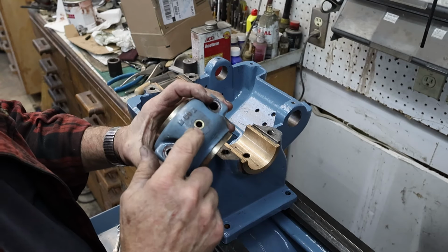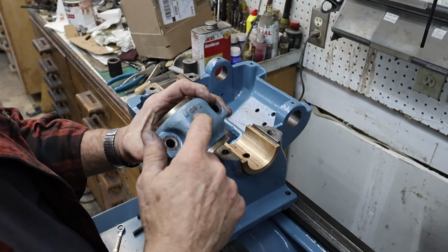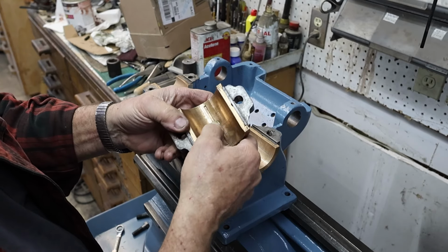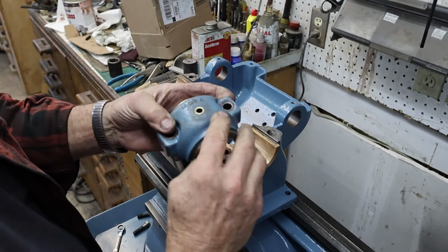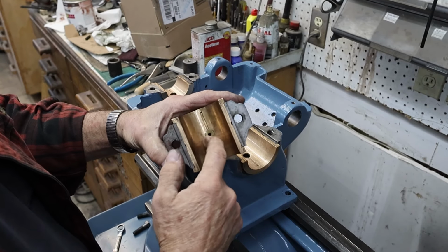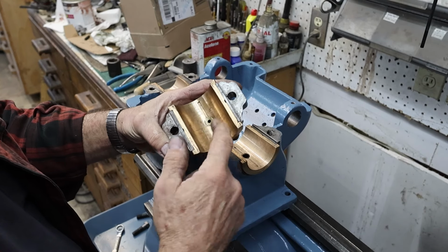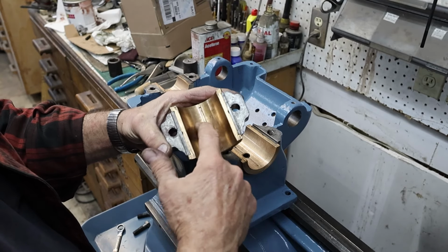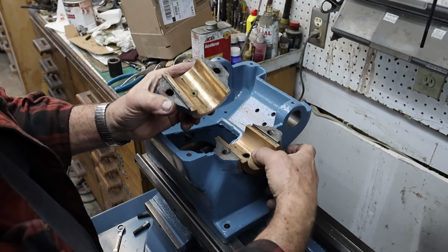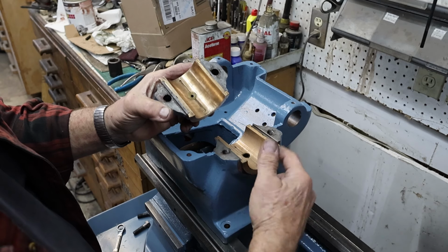One of these bushings, I think this one was sticking quite proud, so when they put the bearings in, or last time they were messing with it, they didn't get it aligned, because it's kind of a hassle to get them aligned in there so that it slides both through the bearing and then through the cap. So what I'll do is I'll go and I'll relieve these just a little bit on both sides before we bolt it back together. And then the oil also wicks down through both of these into the bottom half of the bearing, and it goes down, and there's another little insert at the bottom that's the exact same thing. And the bearings are made the same way.